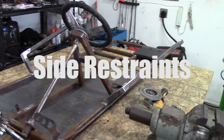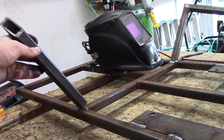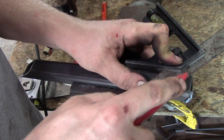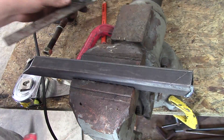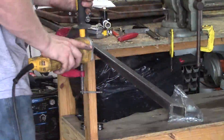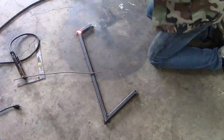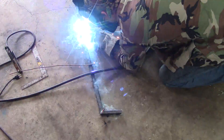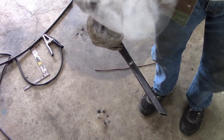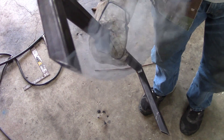With the side restraints, they're cut on opposite degrees. One is on a 45 degree angle in one direction, the other is in an opposite 45 degree angle. The top or the larger portion is cut at a 35 degree cut for a 70 degree angle overall, and the bottom portion is cut at a 55 degree cut for a 110 degree angle overall.